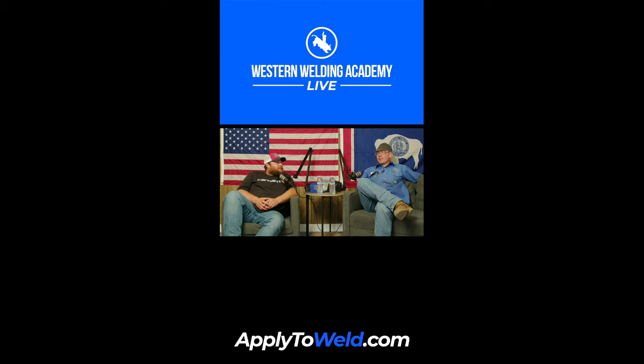Next up — Aiden Wilkins. Looks like more farmer rod on AC or something. I've only welded with an AC machine a couple times. My father-in-law had one — I went over with a 30-year-old rod and welded his bale spikes back together. They weld weird but they get it done. Looks like this guy's learning. Got to clean that thing up — looks like it might be galvanized with that weird white on the edges. I'm going to say seven.